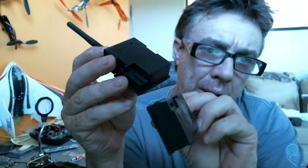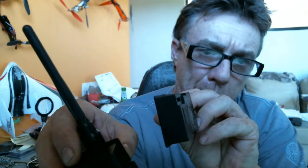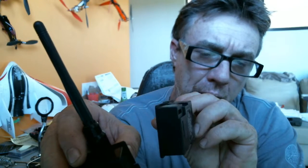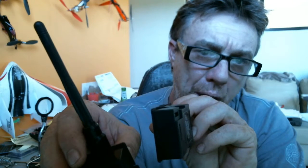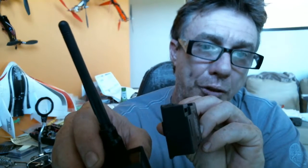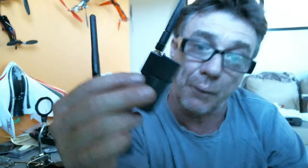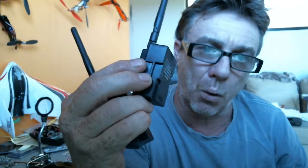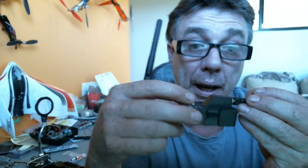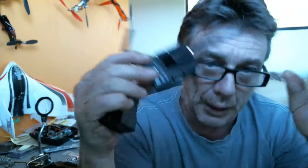For this one, the pins should be okay at the same length. The mod is that you remove the board that holds the pins down — it's only four screws that hold that on. You release that from the board and cut the molded plastic post which holds the five pins. Otherwise you can mount this in the radio, but the right-hand click on the back won't click. The left-hand one will, and it's in there and it powers on. I've checked it and I've bound it to a receiver that came with this. Happy days.